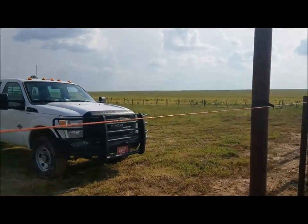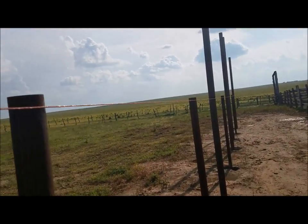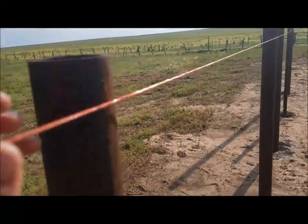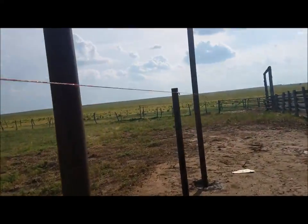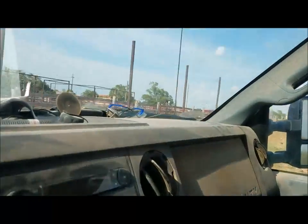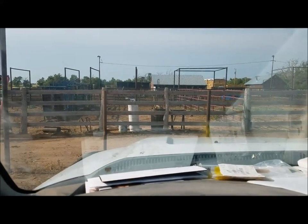This alley we're doing on six-foot centers. We set our top string — it's sunk down some — but this is where we're gonna put our top rail. We'll saddle these. Finally have a bunch of pipe that's not lined, so that's amazing. Those are our top posts. If you haven't built pins before, we do it that way so we know they're all in line at the top, then we'll plumb them to that line so our rail's not all over the place.